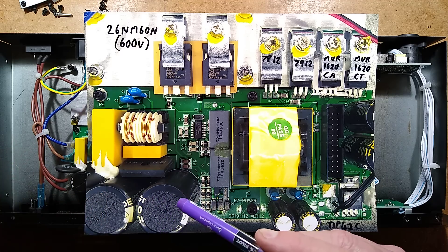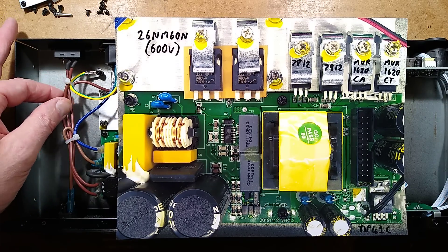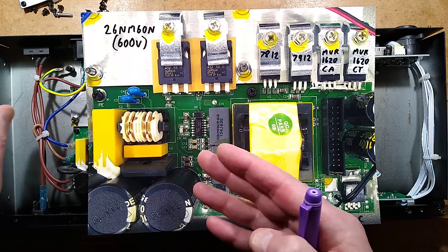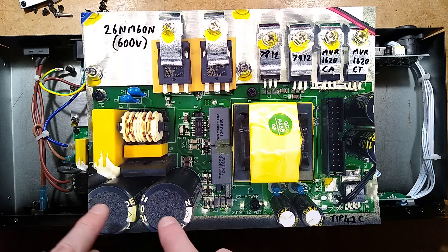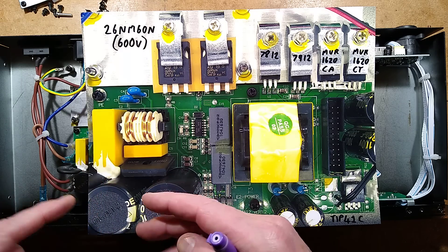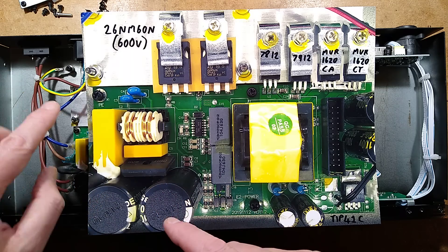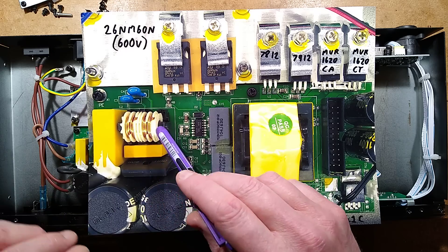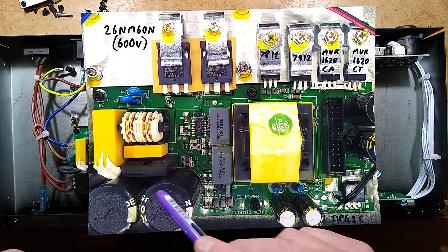There are two capacitors because of the voltage selector switch — it can bridge out part of the bridge rectifier effectively and do a push-pull thing for 120 volts, charging both capacitors up to get a decent voltage inside. With 230 to 240 volts it charges up to around 330 volts, but with 120 volts it'll also charge up to that. We have a common mode suppression choke and class Y capacitors going down to the local ground pin.